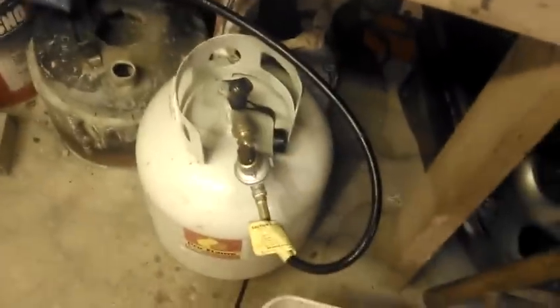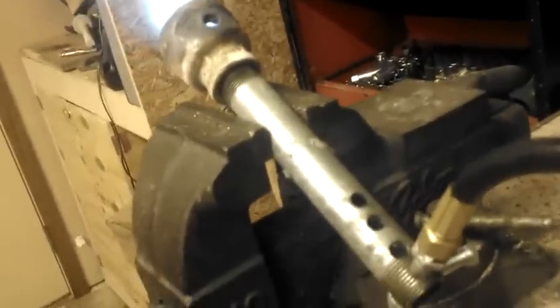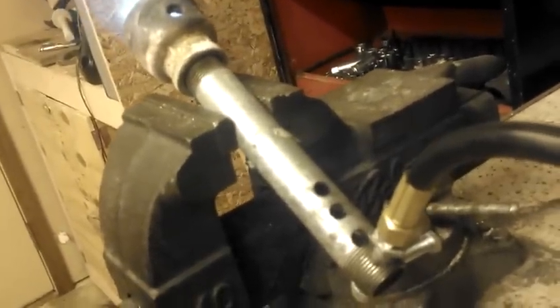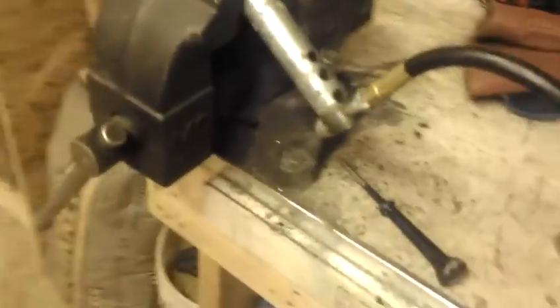And nice big flame. Right now I've got my propane regulator on about as low a pressure as it can go, and the flame seems to be doing fine. If I turn the pressure up a little bit, it actually doesn't really seem to be doing anything. Turning the pressure down makes the flame go down, but it comes to a point where the amount of gas that can exit the burner is actually controlled by the diameter of the hole where the gas exits.